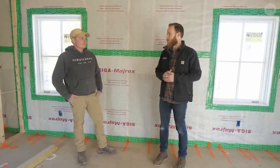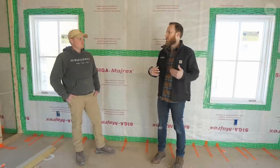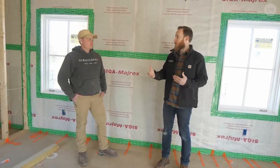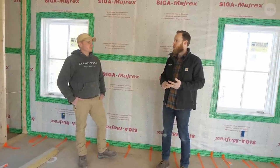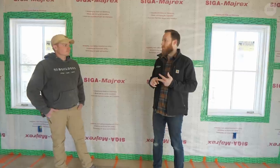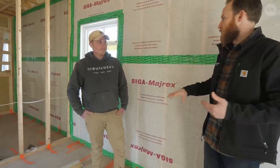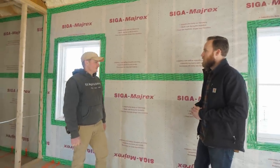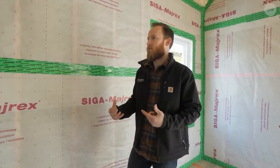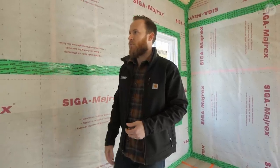We worked with Ramon and decided to use mineral wool. We did all of the walls mineral wool with the exception of our brick walls — we left those as is. We didn't have a cavity, and the double-wide brick plus our air-sealing details was going to perform at an acceptable level. Then in the new cavity — which we're standing in right now, the addition master bedroom — we used mineral wool and talked to the guys at Siga about this product. Anything we can do to help the house perform better rather than rely on one particular system and look at this holistically is the benefit.